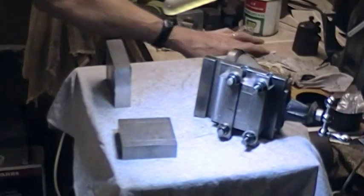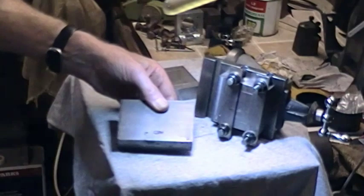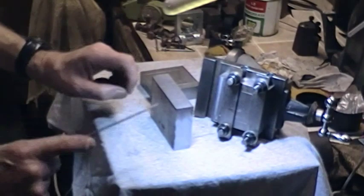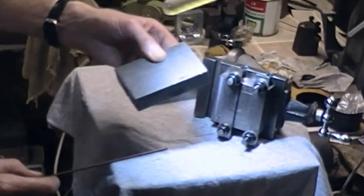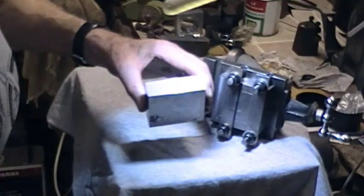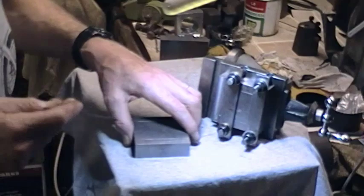The object of the exercise was to make a near clone. To that end I looked through to see what material I had, and the closest I had to be of any use was this metric stock which is 75 by 25. With some difficulty I used a cutting disc with a hand grinder just to give me a start, and that gave me two pieces which I machined each end, so I finished up with a nice square.